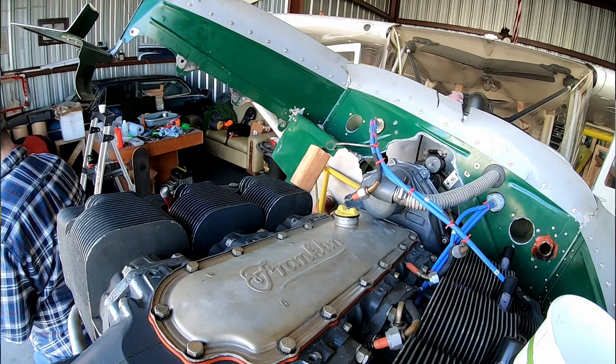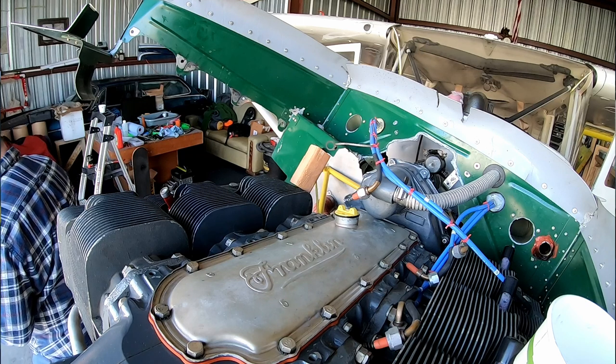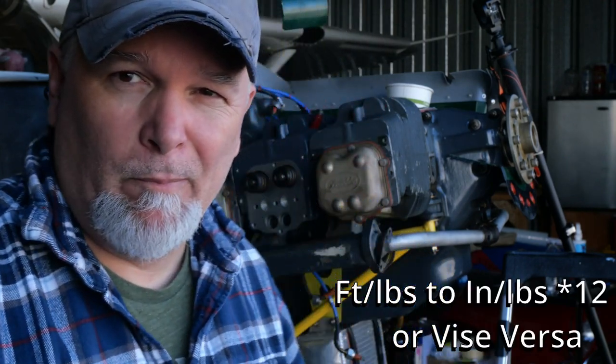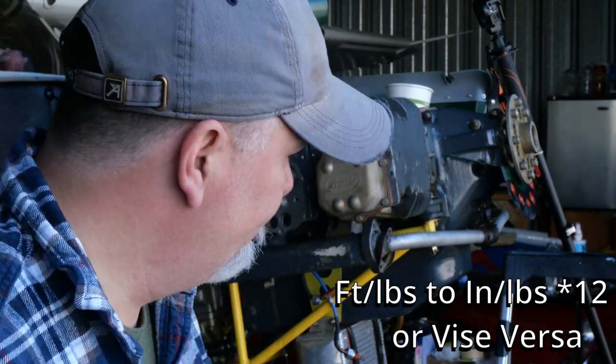We've got two diameter studs for the hold down, and we have a 3/8-24 and a 7/16-20. The 3/8, we're going to torque between 240 and 300 inch pounds. And the 7/16 are going to be 300 to 330. So what is that? The 7/16, roughly, was that 27.5 foot pounds? And the other one's going to be 23, if I'm calculating in my head correctly. So we're going to do the big ones first because they're on the inside, and then we'll do the outside ones.